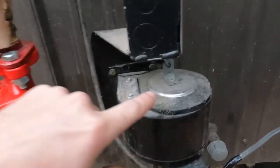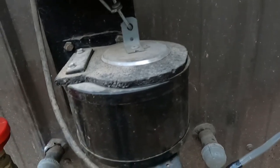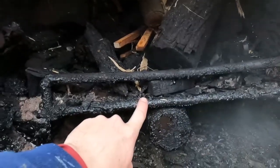The reason is it has a five-degree differential. If not, every time it dropped a degree you'd constantly be kicking the fan off and on. So the thermostat gives it five degrees of buffer. When it hits 140 it will kick that fan right here, and it will pull that lever and open it up to let air blow up underneath. There's a metal grate underneath it — here's your metal grate right here.